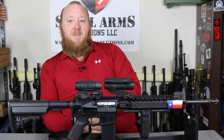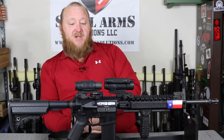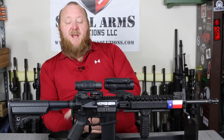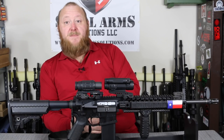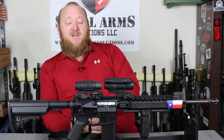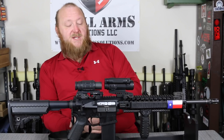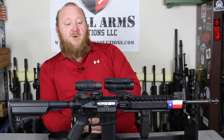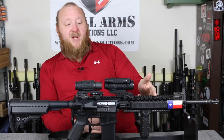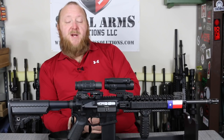For instance, with a standard carbine gas system, within 6,000 rounds for the military specification, you have a cyclic rate at the beginning of 750 to 950 rounds a minute. After 6,000 rounds, your upper limit will rise to 1,025 rounds per minute. So that shows you how much of a difference just having gas port erosion will make in a short 6,000 rounds. So you figure you have higher pressures to begin with from the shorter gas system. You get higher pressures, the bolt's opening up sooner. Eventually, that's going to cause you problems with extraction, and your extractors are going to have to work a lot harder.